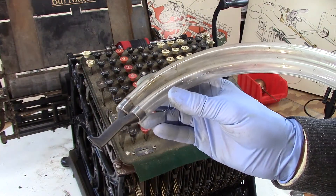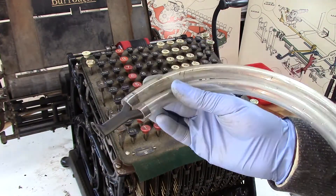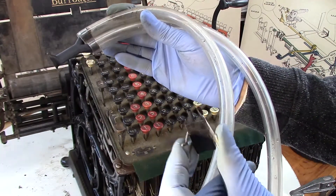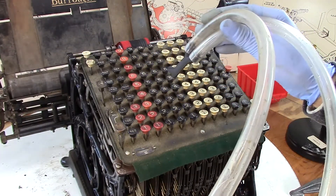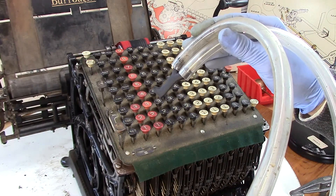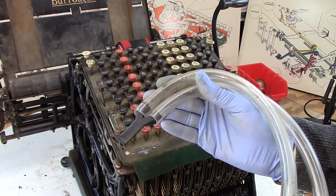I've tested it previously on an old phonograph that had felt on its disc — it was quite dirty and it seemed to work pretty well as a quick little test. Hopefully I can refine this a bit more. On the water side, you'll need something to choke the flow down — the big thing is to just have just a little bit of liquid coming out, being withdrawn at about the same rate as it's being applied, so it doesn't go down into the machine. I'll start very conservative and work my way up.